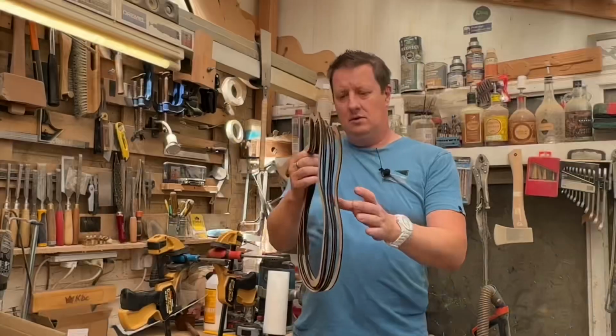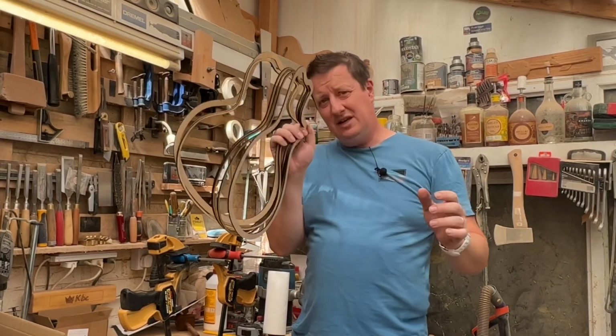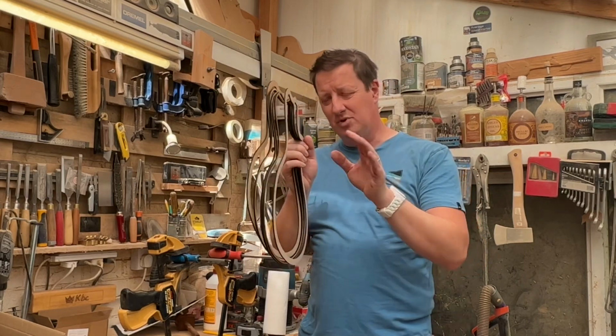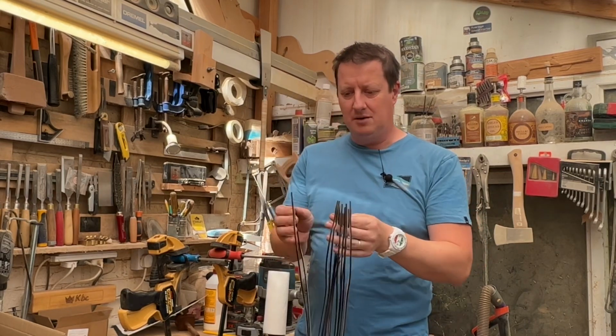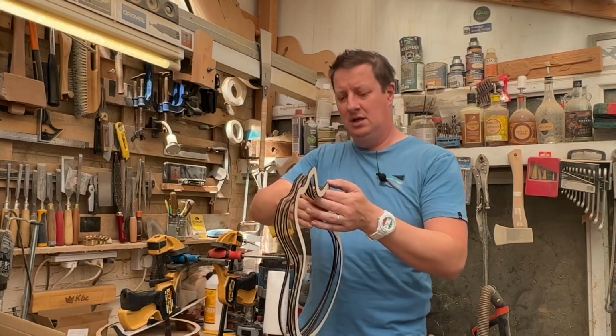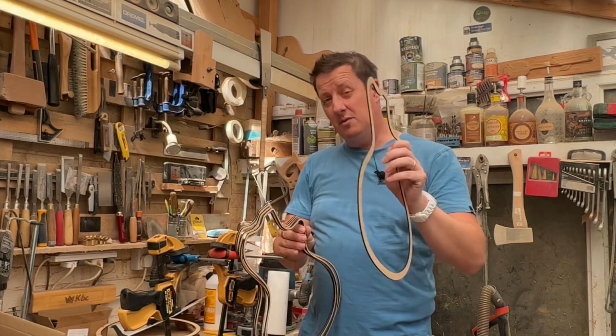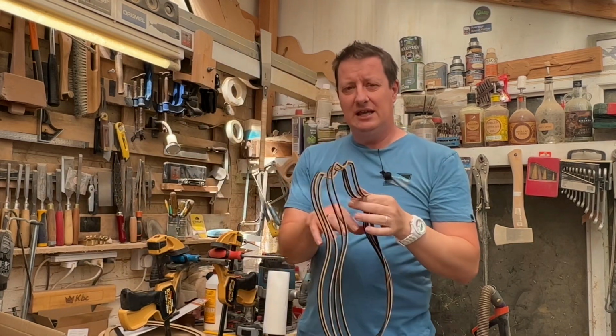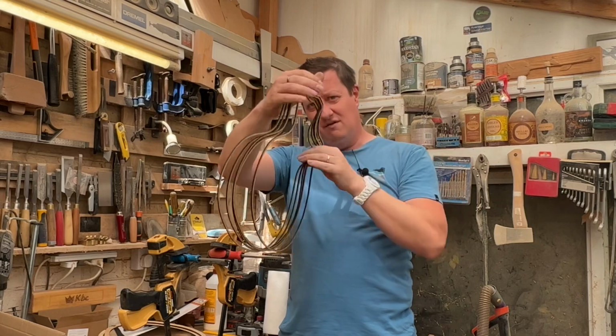Yay! Now, back to this guitar building malarkey. Okay, so we now have these 7 individual pieces that we now need to glue together. Now, they're quite floppy and are going to present a few issues. Firstly, I'm going to remove these thicker sections. They are the outside edges that the actual face of the body will glue onto. Leave those for now. So that leaves us with 5 super thin flexible things.